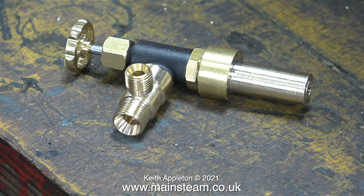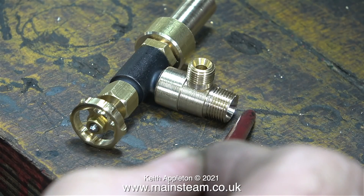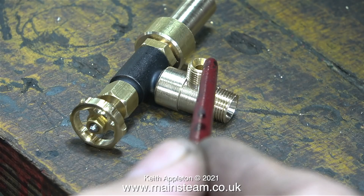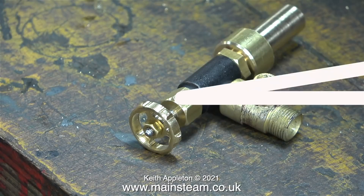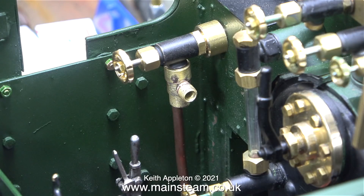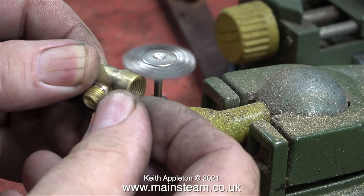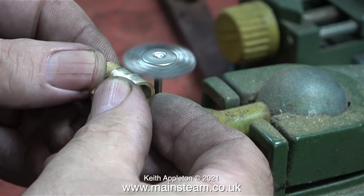Here is the tee piece. The thread on the end of this is 3/8 by 32 threads per inch, but this bit that I'm temporarily putting in place is threaded 5/16 by 32 threads per inch. The pipe that carries water from the output of the pump fits onto this thread. The union cone and nut are already on the end of the pipe that was in the engine to start with. This outlet connects to the check valve in the boiler, and this bit sticks through the hole into the tank. This clip shows the tee piece after silver soldering. I thought it would be a good idea, before tackling the problem, to clean up the freshly silver soldered tee piece using my Proxxon motor tool in the bench mount.